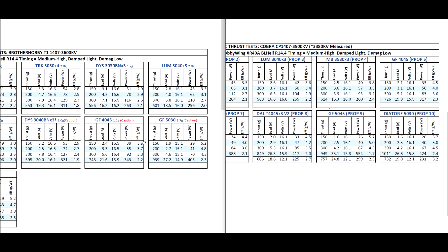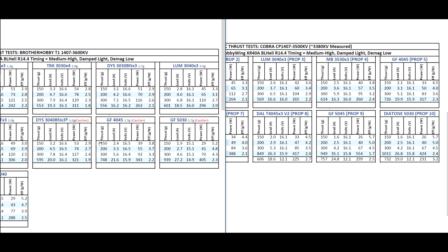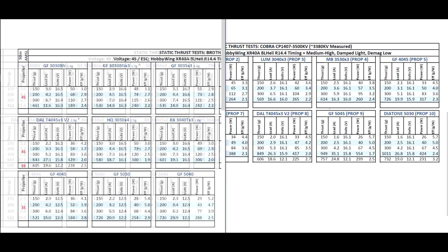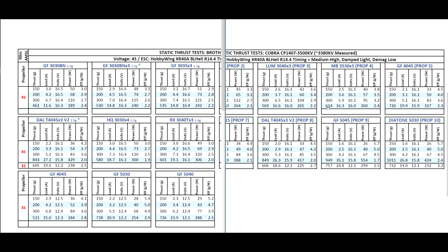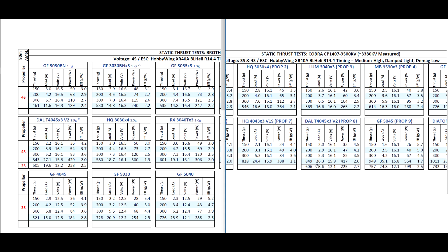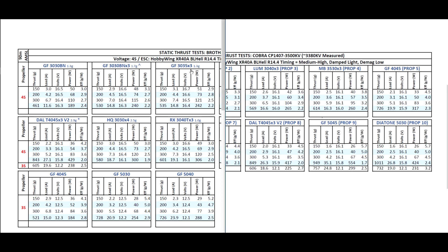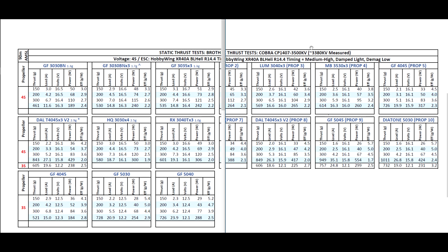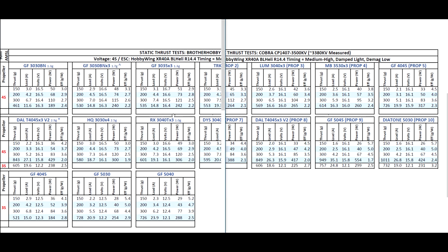The only thing missing here is the kV. I went for the mid-kV and didn't order the 3750kV — I'm sure that motor would have quite high performance and higher thrust. This gives a good indication of the motor's capability: with 4- and 5-inch props it's very capable and not using an excessive amount of amps. If you're running 3-inch props, you might want to get the higher kV — perhaps the 3700 or 4000kV versions. For 4-inch props, this kV might be a better choice, unless you want full-out speed, in which case go for the 3700kV. That's the thrust test and review — I hope you find this data useful. Thanks for watching.